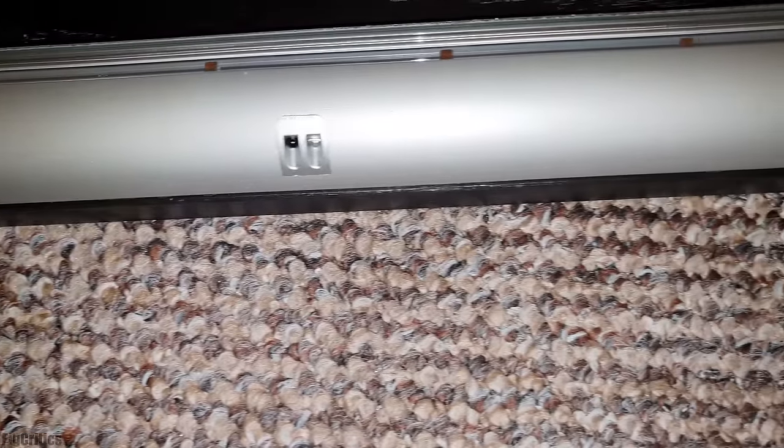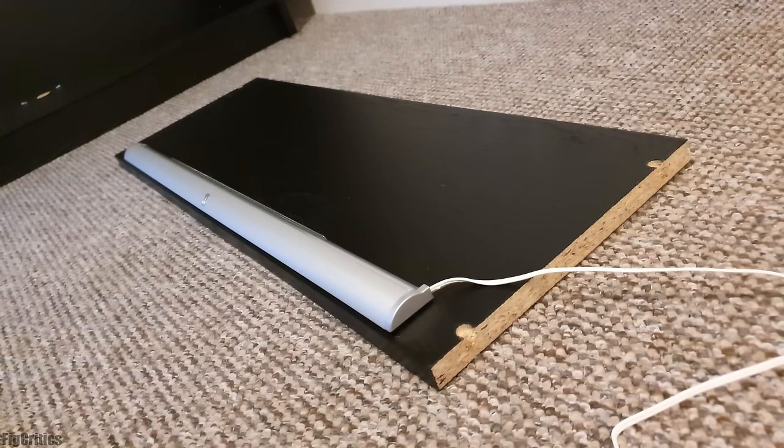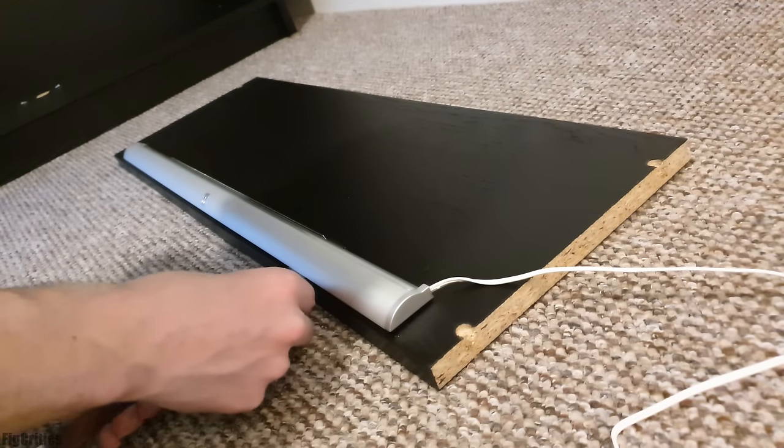Oh, and here's the reason why I recommend to put 1 centimeter between the installation bar and the front shelf edge. It makes it look very clean and professional, and it also ensures that the LED lights fully light up the entire shelf block. Now, if your measurements were slightly off, please don't attempt to remove the NorFly light unless you have a replacement one.